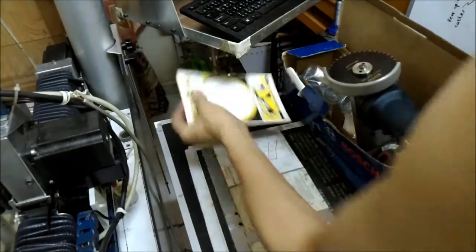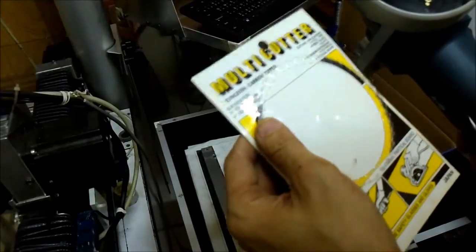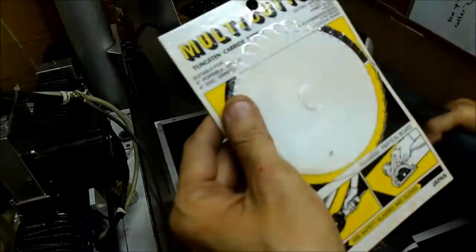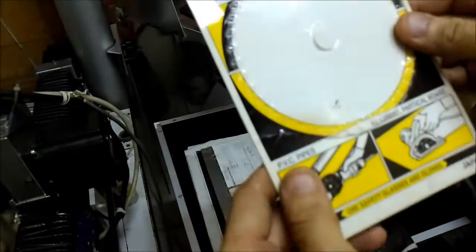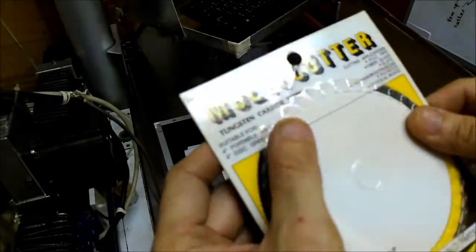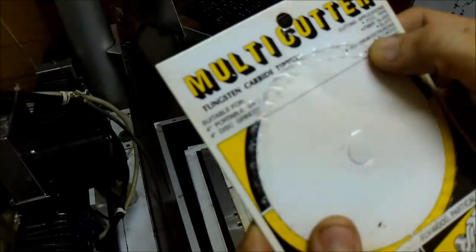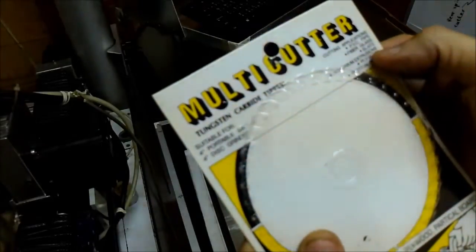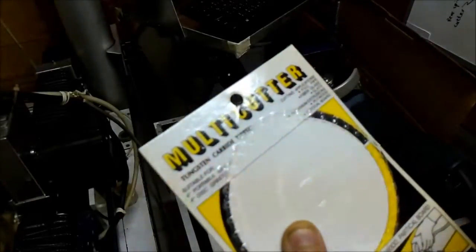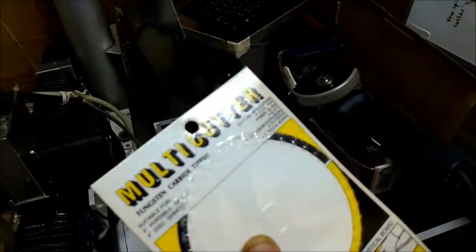This grinder machine uses this grinding wheel usually, but I checked and it can accept a 100mm cutter. Here is the cutter — this is quite a good piece of circular cutter with tungsten carbide tipped. It is from Japan and it says that you can cut aluminum extrusion, so it is not for heavier cutting aluminum. During cutting we have to adjust the depth of cut to a very small amount.